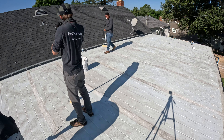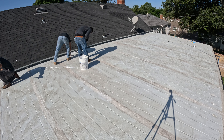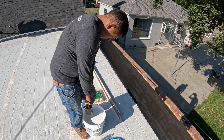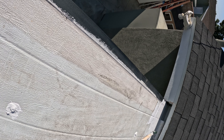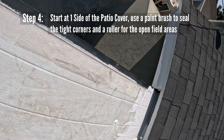They mounted up under the fascia board, and when they added the flashing, water was getting behind the fascia board and sitting underneath the flashing. Generally you don't want flashing on insulated roofs unless it's got a lot of pitch and is really installed right, because you have to seal the roof, wait a couple days, and then put it back on. That's a really big no-no on insulated roofs.